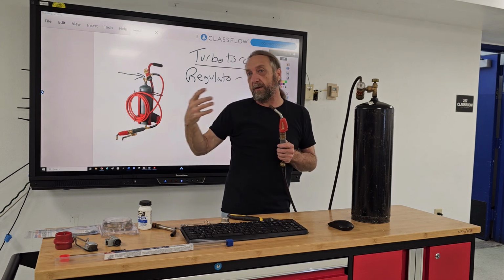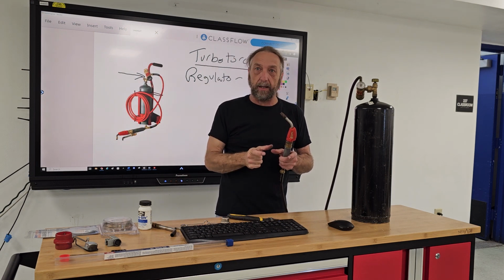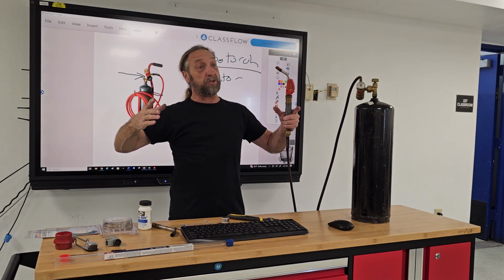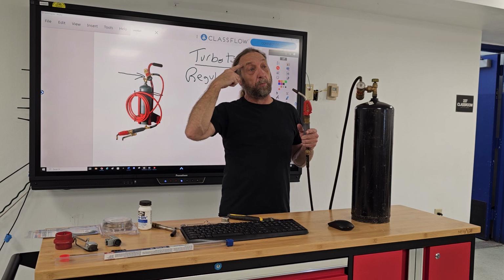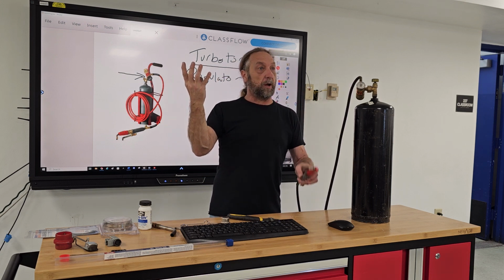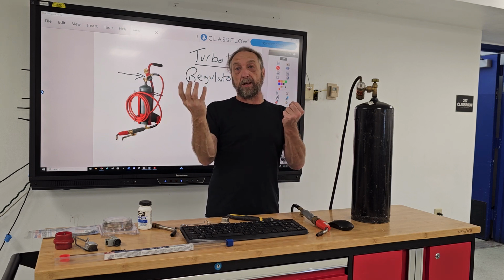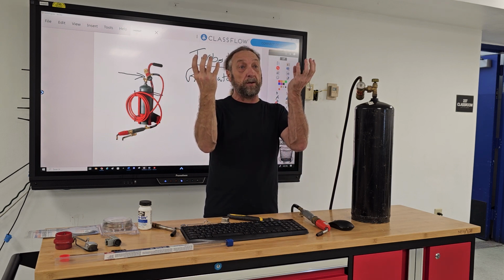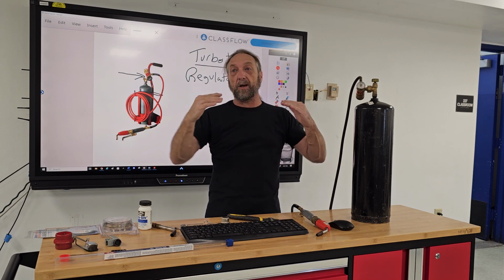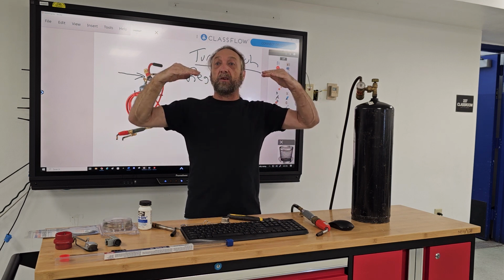It's the same thing like when we have a gas stove or a gas dryer. Those appliances have regulators on them, so that like if you had a gas stove with 4 burners on it, just imagine, think of a burner as like a sprinkler of a hose. I turn on one, the flame is going to come out. Well, if I had 2 sprinklers on the same hose, and I turn on the second one, a lot of people think they would both drop down. But what a regulator does is a regulator will open up and allow more gas so that the flames aren't going like this.